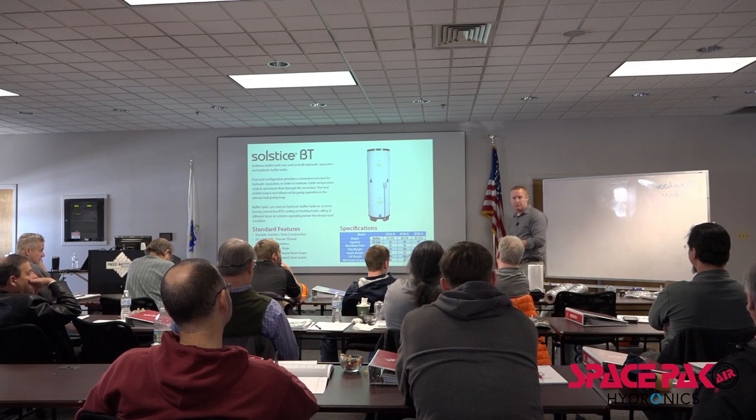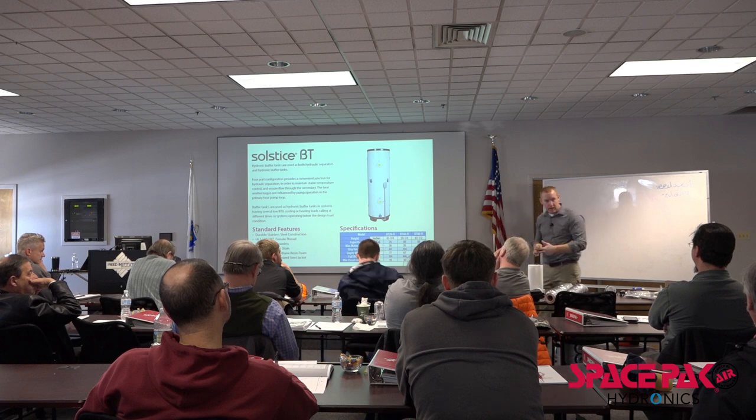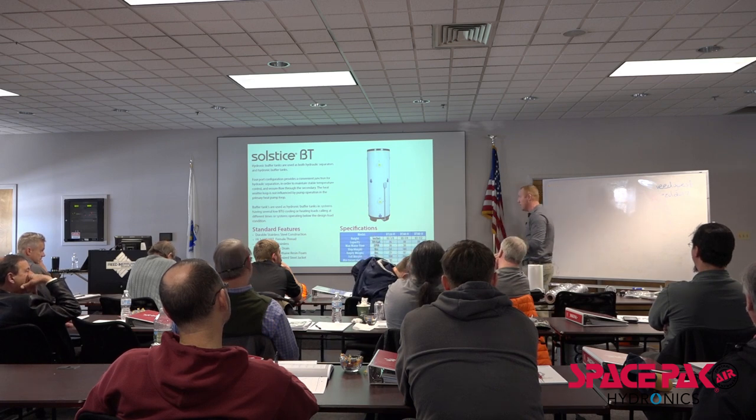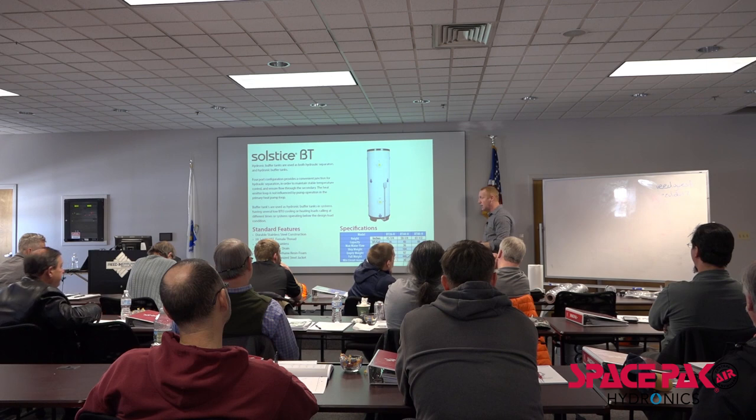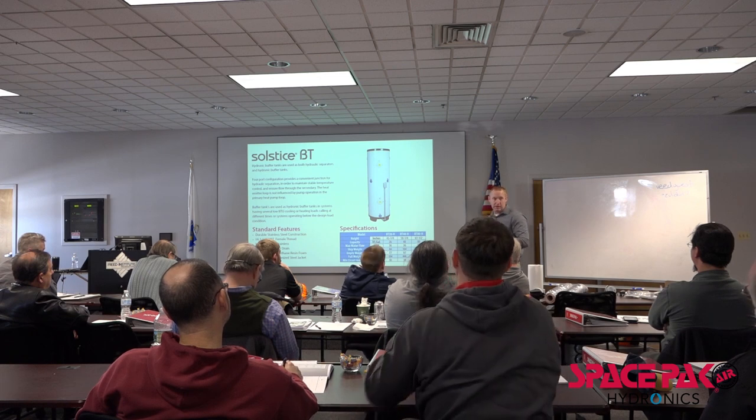There's a couple different reasons. We use buffer tanks for thermal storage. We use buffer tanks for hydraulic separation, right? Dissimilar pumping. SpacePak has a stainless steel buffer tank, a really well-priced stainless steel buffer tank with a 10-year warranty. I can promise you that if you do any kind of chilled water applications, you want a stainless steel buffer tank. You do not want a carbon steel buffer tank.